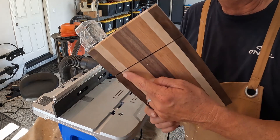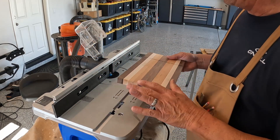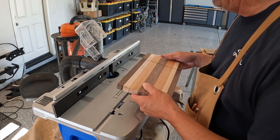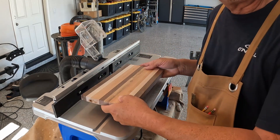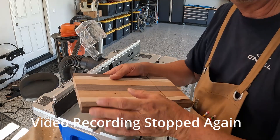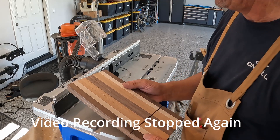Now I've got all of our slicer grooves cut. We've got all 12 boards sitting over here. Next we're going to run the boards on all sides through the router and just give a round-over — a little quarter round on every side — to kind of soften it and make it easier to hold. So that's what we're going to do next.